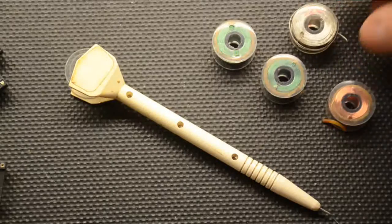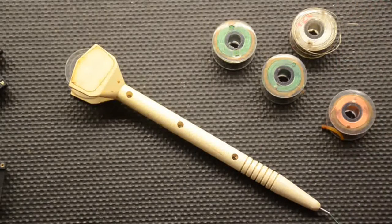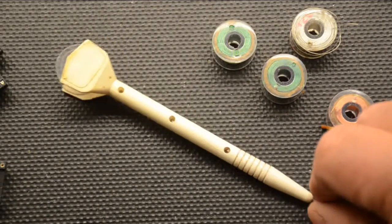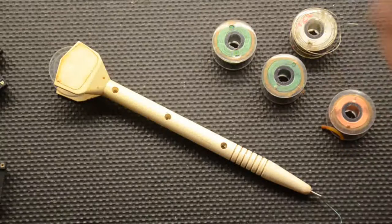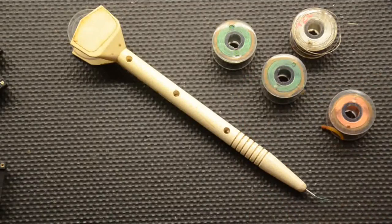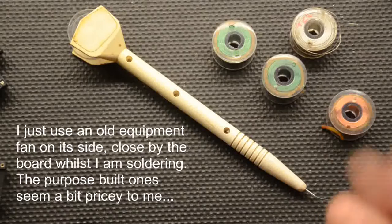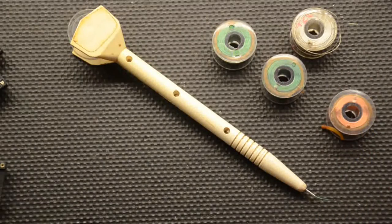These are insulated wires - that one was actually bare tin copper wire, but these are insulated. What you do is wind the wire using the pen around each IC leg, feed it through the combs, take it to the next one, then solder it. The solder burns off the enamel insulation. It's quite nasty stuff - it releases really toxic gases, so it's a good idea to do it with a lot of ventilation. Other than that there are no real issues with it.